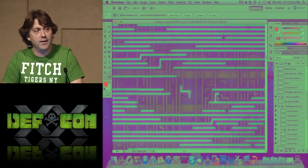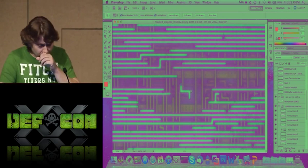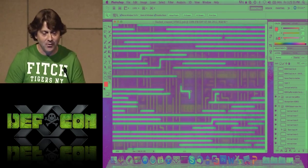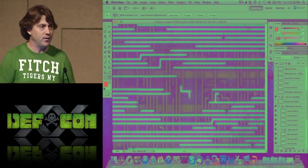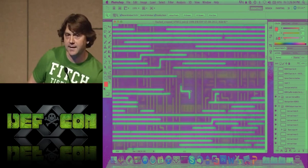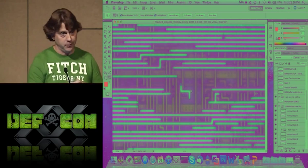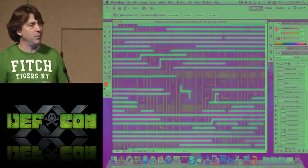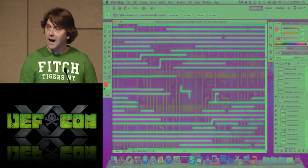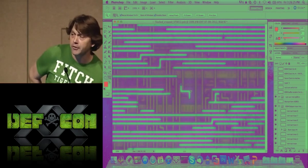So ST likes to do a lot of funny things, a lot of weird things, a lot of things that I have no idea why because I don't work with them. One thing that they like to do is drop in what I call dead gates. And I don't know why they do it. It's almost as if they think they'll scare you off if you're going to try to polish them down or something. So they leave these gates that are actually strapped off, tied to the ground fingers of the mesh that's now been removed. So in theory, if you're an attacker and you don't know anything, you'll think the chip can never run like this because there was a signal tied to the mesh's ground finger, and I've just cut this finger off. But it's not true at all. It's completely bogus.